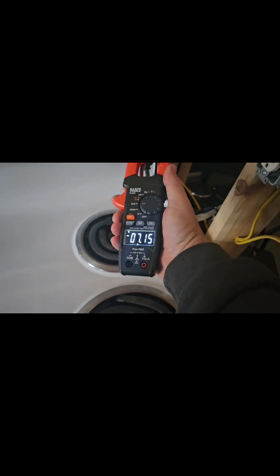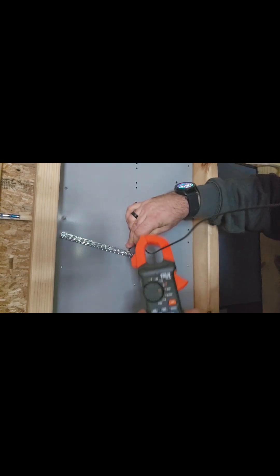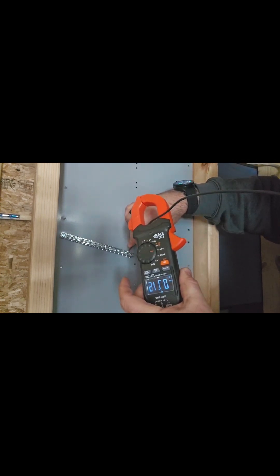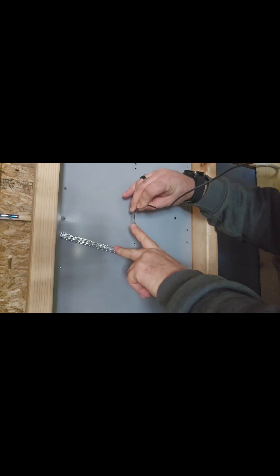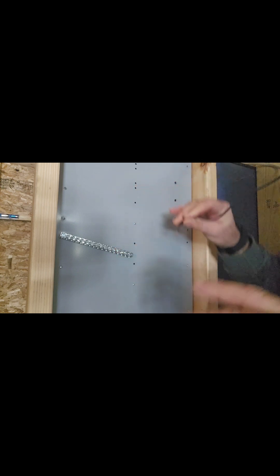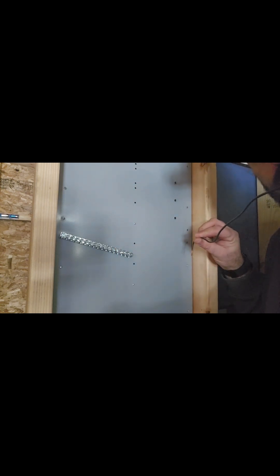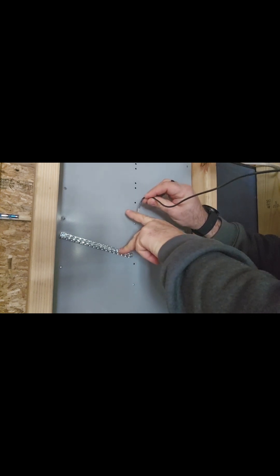If I disconnect that, that'll double. But there's no shock hazard as of yet. That is seven amps on this wire. And if I disconnect it, we have arcing — see the arcing? Very subtle, hopefully it shows up on camera, but there is no shock hazard. There is no shock hazard with objectionable current as long as the neutral is good. It's when the three-wire neutral at the panel, the receptacle in the oven goes bad — then you have a shock hazard. The shock hazard doesn't exist as long as the neutral is good.